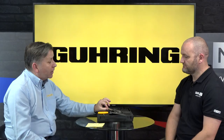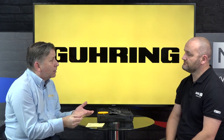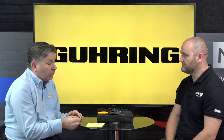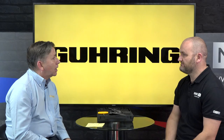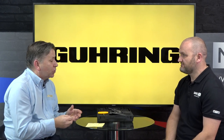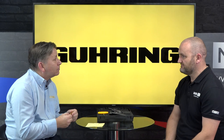What I've found since I've been out selling it in the last couple of years is that the other benefit of a wiper is the way it holds size. We've got wiper on the 104 and the 106, and it can hold 15-20 micron size very consistently. I've even got a customer who had a lot of trouble holding that type of tolerance, now running lights out with our wiper system. I think it's a fantastic part of our range. So increased surface finish, better tolerance, and no loss of productivity. Absolutely. I think it's a no-brainer, really. It's not that expensive, and it's a superb tool. So if you've got any work that needs a good surface finish, or you're holding a tight tolerance, use the wipers.